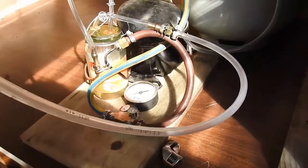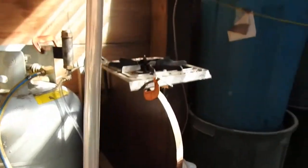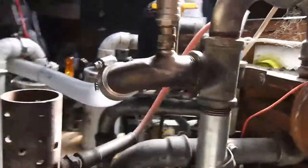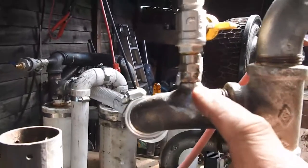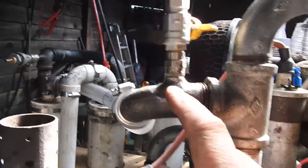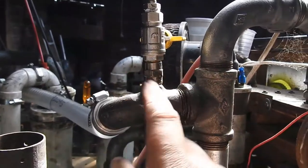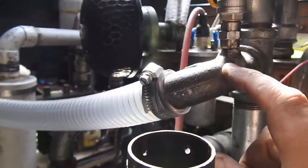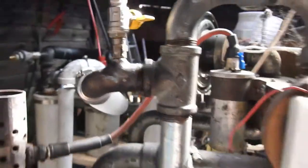The gas that will be bubbled through the diesel is being delivered through this hose — a fairly small plastic pipe — which goes over to the Gas-O-Matic 9000 and is attached here. This was recently attached to the plumbing as of last week. What happens is it takes the filtered gas from the gasifier and delivers it to the compressor system.